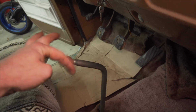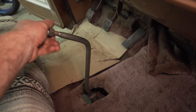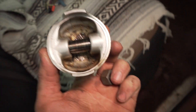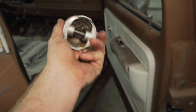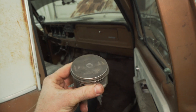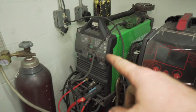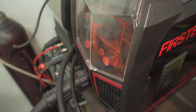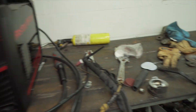So I just have the bare shifter rod and it's not really comfortable to shift with. I was looking around and I found a nut with the right thread pattern. I'm going to take one of my old pistons — I found this one out in my barn — and weld it to the wrist pin and call it done for right now at least, because some of these shifter knobs are like 20 to 30 dollars. No point spending money on one if I can easily make one. Earlier I was TIG welding with the Everlast; now I'm going to use the Yes Welder MIG function because it's a whole lot easier for this.